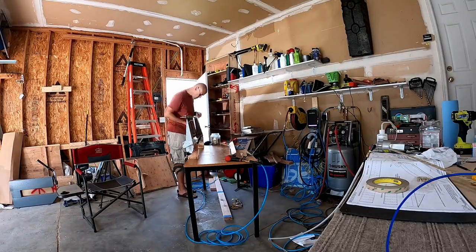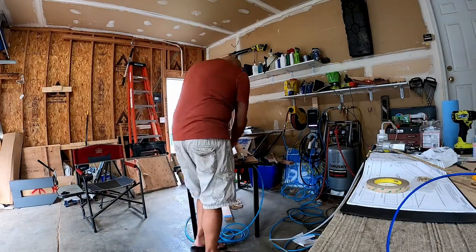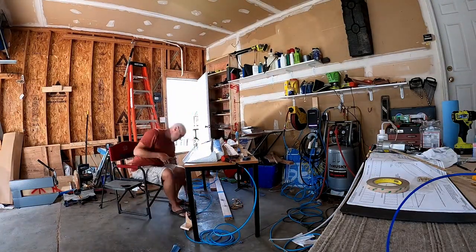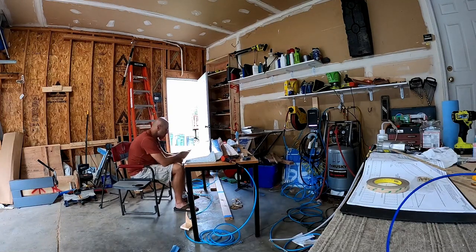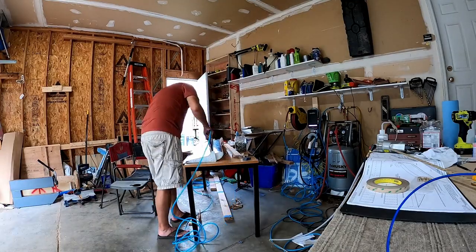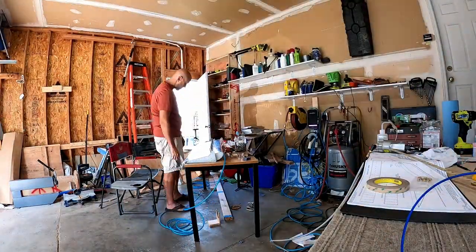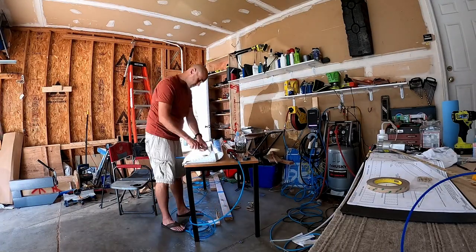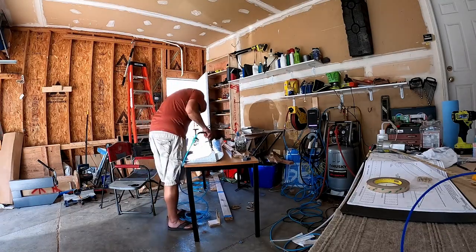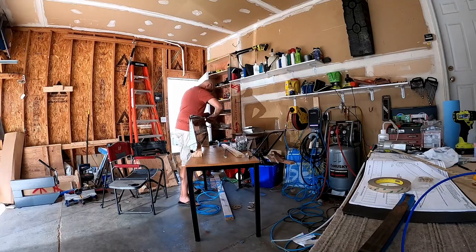I forgot that I did it the right way first — I put it up in the cradle and was like okay I can do some riveting, and then I remembered: no, no, no, I did this on its top last time on this table and it turned out really good. So I need to do that this time instead of trying to replicate what the plans said. Realistically the method in which you rivet doesn't matter — as long as the rivets get set and you end up with a good product, it's fine. Personally I feel like doing it on the table with that long bucking bar where I can just lean on it to set the rivets works so well. It bounces away a couple of times here and there, but it turned out so nice.